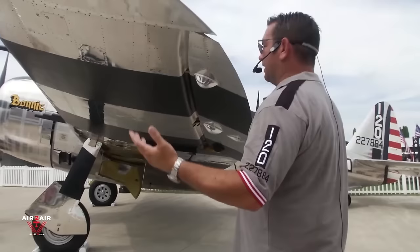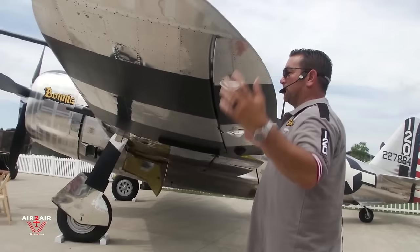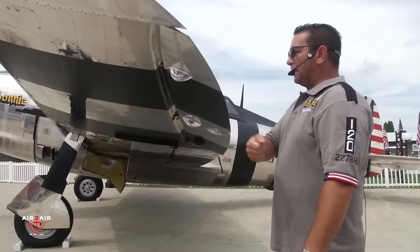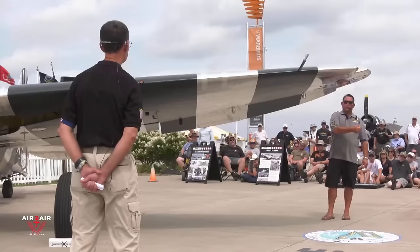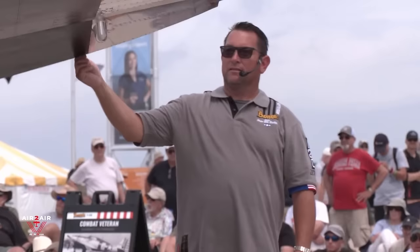Ailerons are really cool. This was something I find fascinating because I like airplanes and I fly little aerobatic airplanes. With the aileron design, when it goes down, the air strikes it here. I thought they did that in the 80s, that they thought that was a new thing. This was like the 30s. They already had the Frise aileron. One of the cool things about this airplane is that when you're flying it, it's pretty light on the controls, but the further you go, the lighter it gets. You get to the last part of the throw, and I think you could just let go of it and it would keep on rolling because it's got that design. It's like a spade.